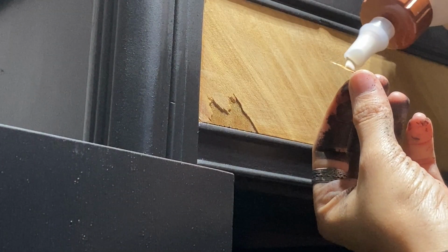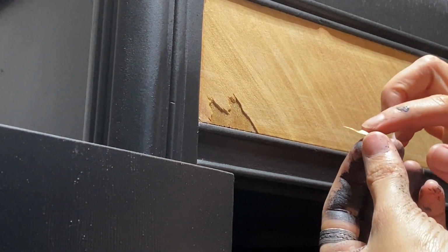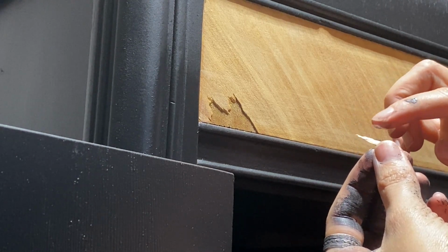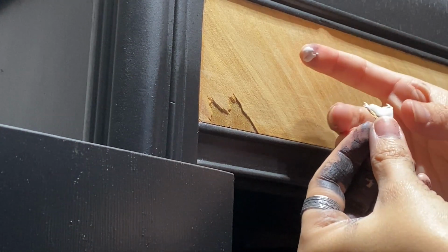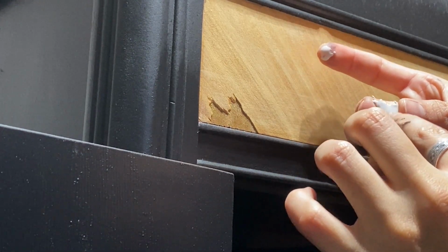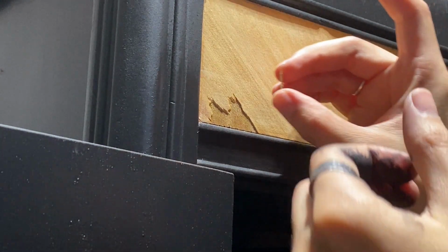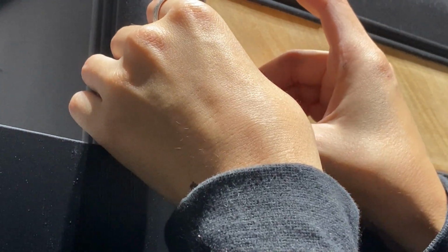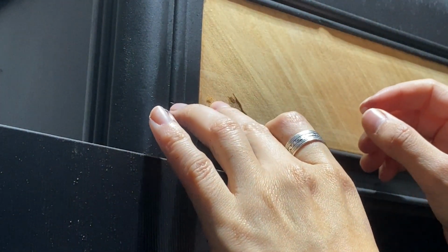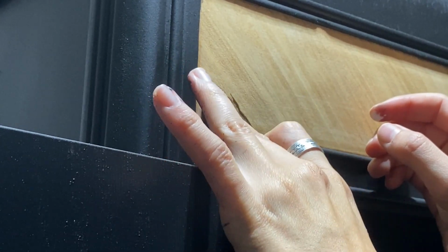And once all the tape was off, I went in there to make the repairs, and I just got some wood glue and put it on the back of the ripped off parts of veneer and then rubbed it around with my finger, making sure to cover pretty much every surface well with the glue, so that every part would stick as well as possible. And then I kind of puzzle pieced my way in there and made it fit as well as possible. But once it's off, it's never going to go back on like it was before, unfortunately.